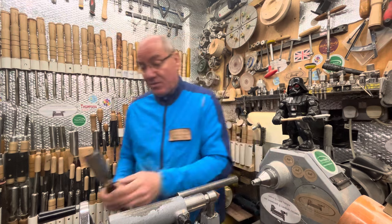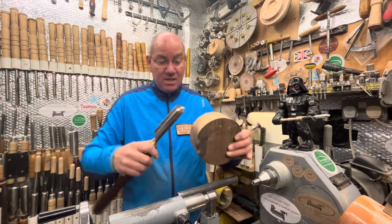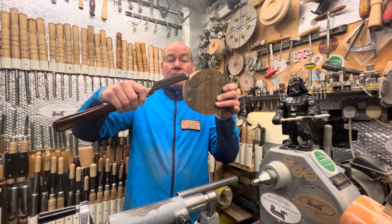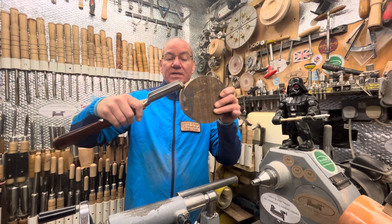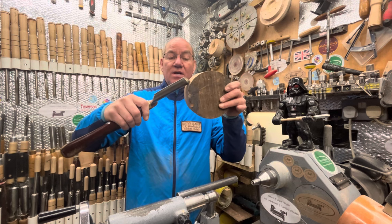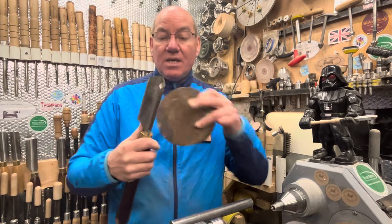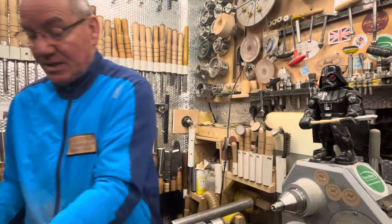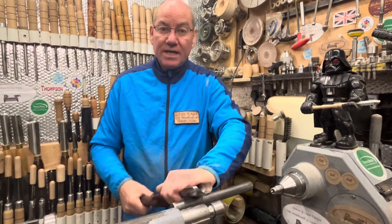Right. For mine, when I pick up my cut, I cut above centre, always. So I'm cutting up here, and all I do is rotate. The minute I rotate, I've picked up the cut. So there, smooth, okay, I rotate, I've picked up the cut. That's the cut picking up, and I've still got full bevel. And when I hold my chisel, I do not hold my hat. I never hold down here and do this.